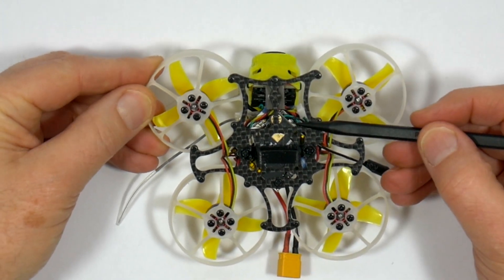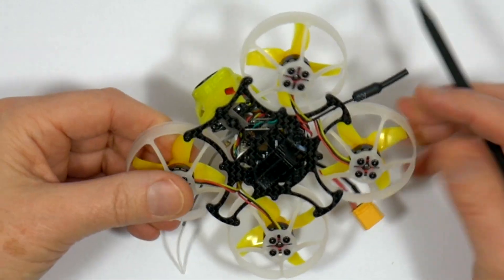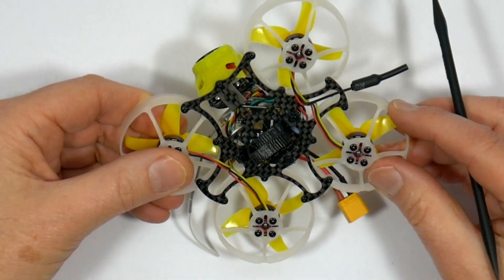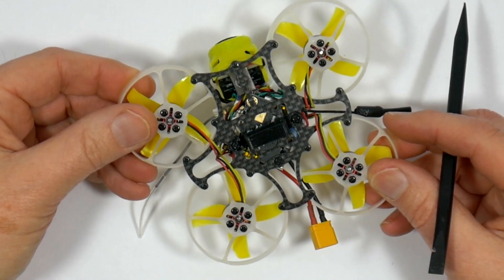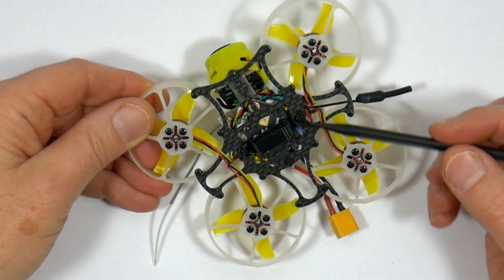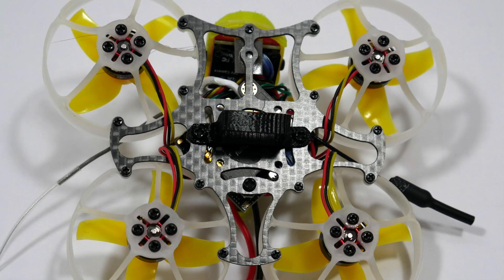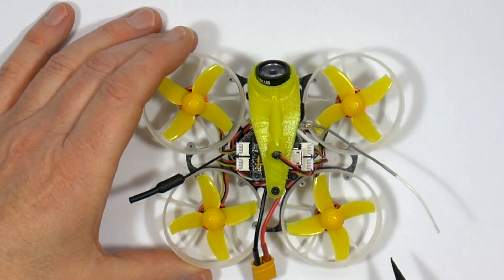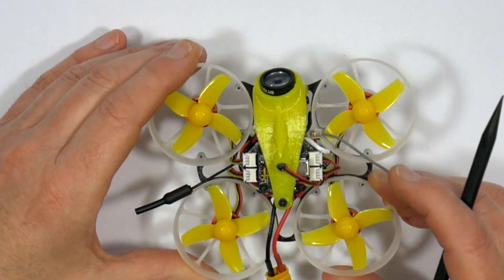Now the frame is where this quad takes a giant leap from the rest of the crowd. There's a real problem using these high KV motors with Tiny Whoops that have plastic frames and ducts, especially on 3S — the frame twists and flexes, and you get a lot of vibration, particularly when you do a free fall then a hard punch out, causing jello in the camera. Full Speed have designed a carbon fibre frame that makes this quad pretty rigid, which is a great idea. It's just one millimetre carbon fibre, and the frame itself isn't actually an X — the rear props and ducts are slightly inset, so it'll be interesting to see how it handles.